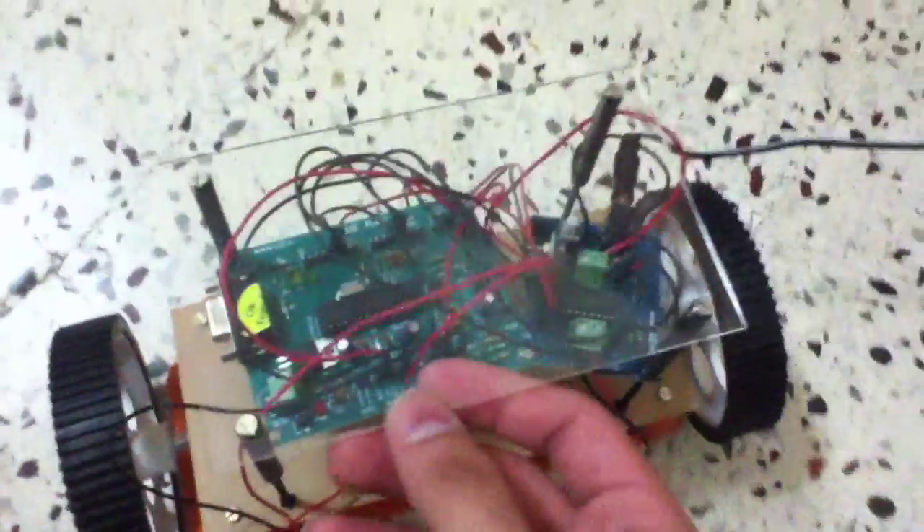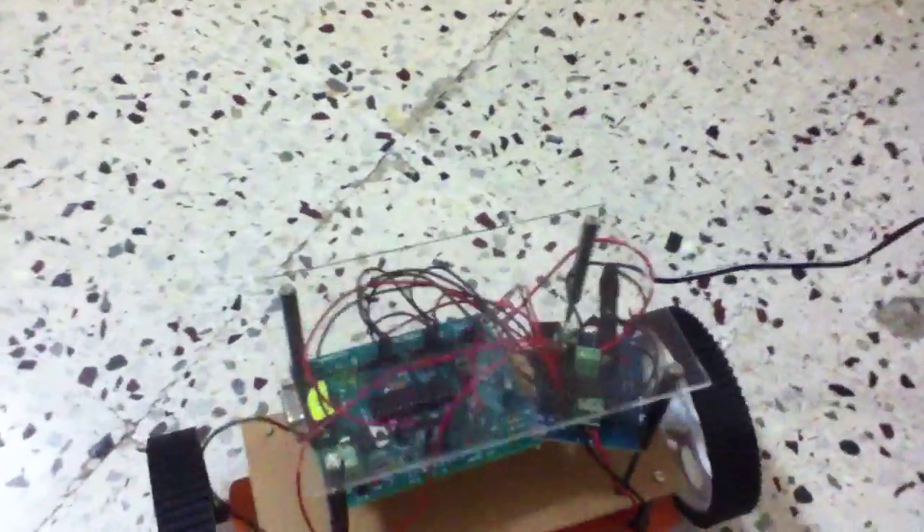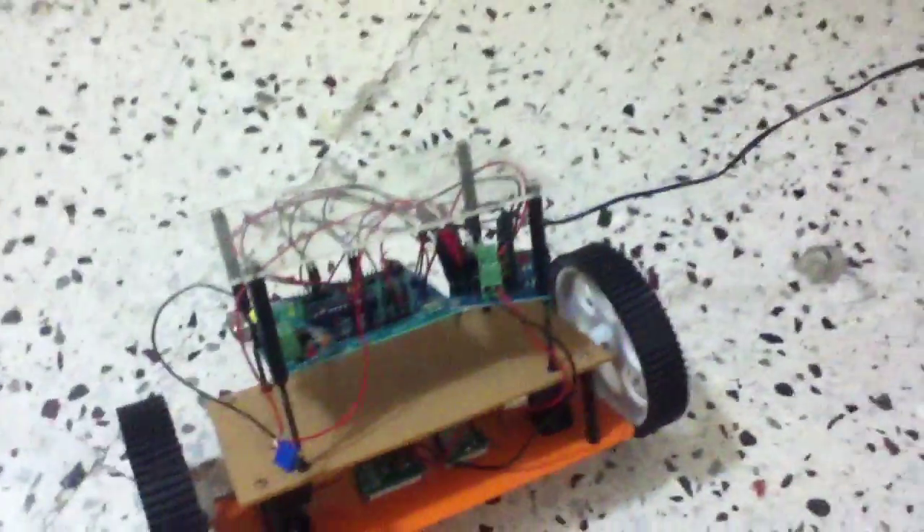I made this in Bombay and wanted to show it to you after it's completely tweaked up. I plan in the future to control this using a remote control, the way I control RC aircraft. But the algorithm I use here has more applications than just this — it's called a PID algorithm: Proportional Integral Derivative. That algorithm can be used for any robot or craft which has self-balancing or self-correcting properties — it can sense the error and correct itself.